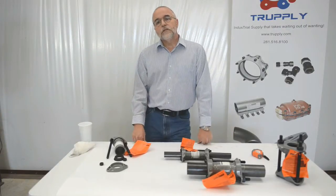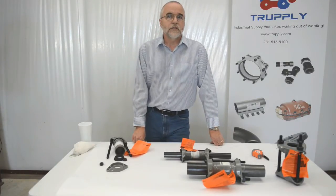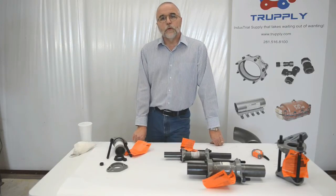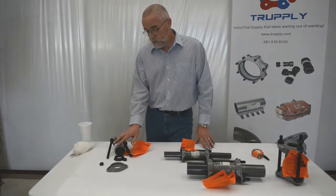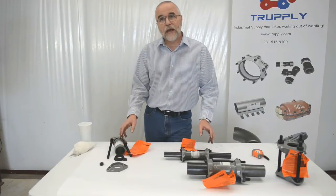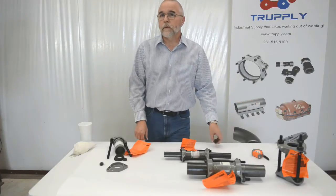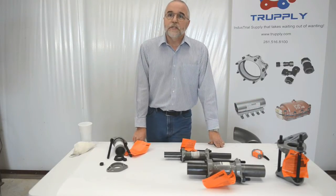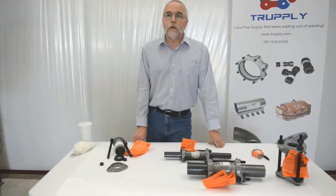The light pattern comes in 2, 3, 4, 6, and 8 inch, and is very good for low-pressure water applications. It is a lighter weight steel, a little bit shorter and thinner material, making it a little easier to handle. Especially in 6 and 8 inch, where a regular coupling may weigh 25 or 30 pounds or more, the light pattern may weigh only 15 or 16 pounds — much easier to handle for low-pressure applications.